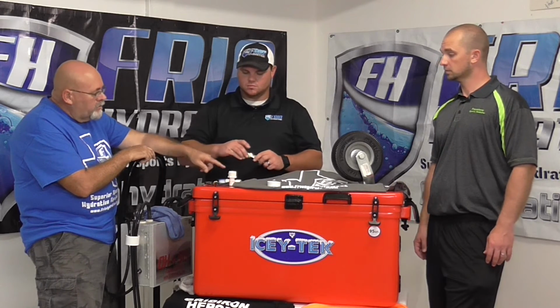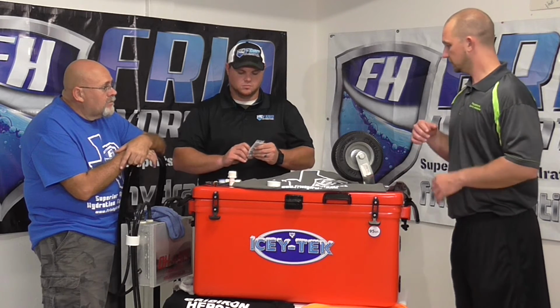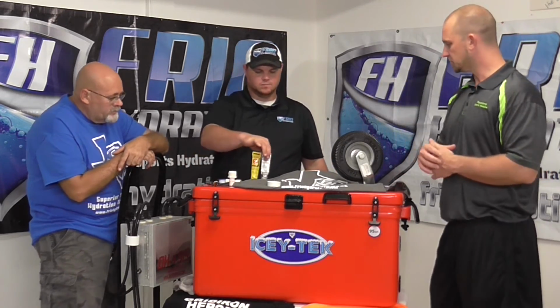One other thing, your pipe dope, make sure you get one that is for potable water. Excellent point. And then quick question: does it matter if we wipe up the excess? Because you know when you squeeze it in there. No, it doesn't matter. Okay. So make sure you get the pipe dope, potable water, Teflon tape. Hold in your left hand. Apply away from you, like you just did there, so that when you screw it on, it tightens down.